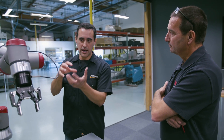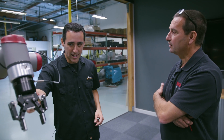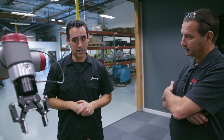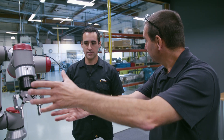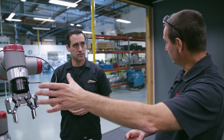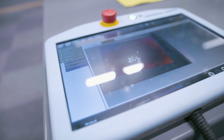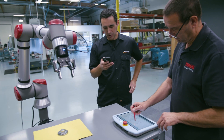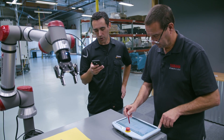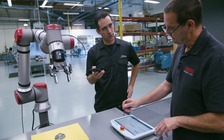So the end effector — if I have a vacuum gripper, I just take it off, put the camera in, put it back on, but I can't block the vision. You cannot block vision, so what you would need to do is offset it, and that's very easily handled here — you just put that in the TCP. Someone also commented on the YouTube video: make sure you grab the latest PolyScope version. It's almost always worth using the latest version — 5.3.1 as of this writing.